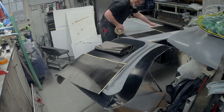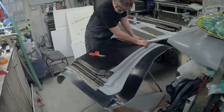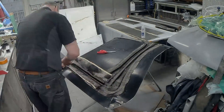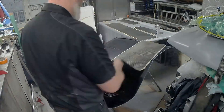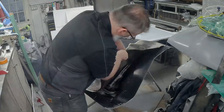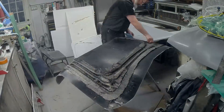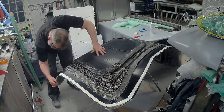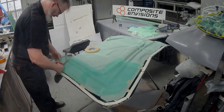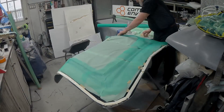When I started in on the rest of the frame — this sort of bigger hoop — I measured all the fabric and weighed it to make sure I was going to do this all properly. Fit it in as carefully as you can. I didn't have any problems with it when it came out, so that was good. That all went in pretty lickety split — this only took a day to load both moulds. The other mould was already sitting on the hood of the car, already infused and clamped off, hardening. Epoxy doesn't dry — it hardens. Totally different process.